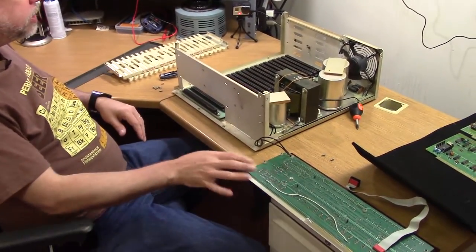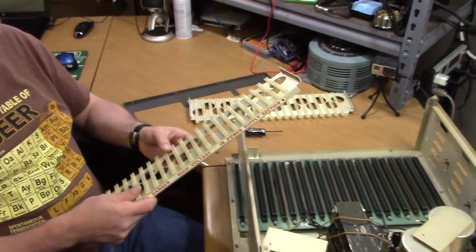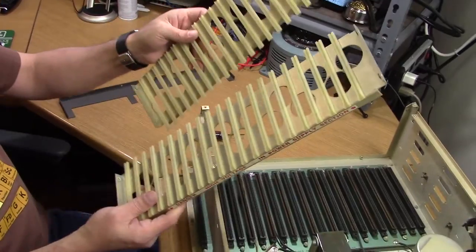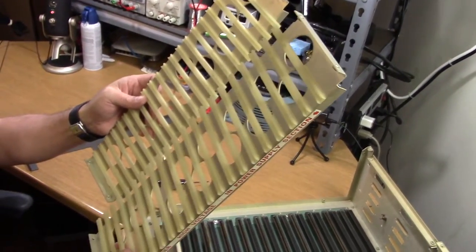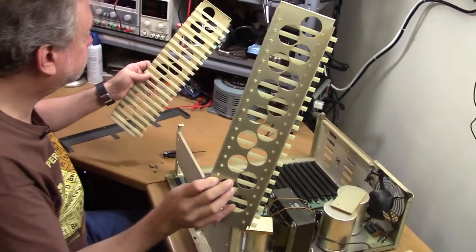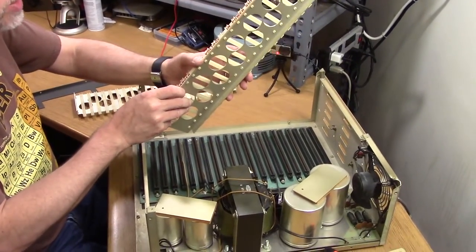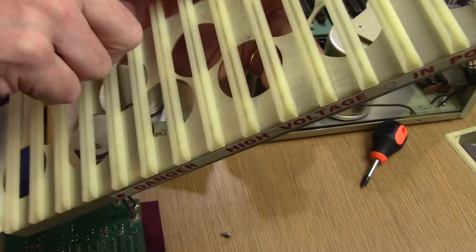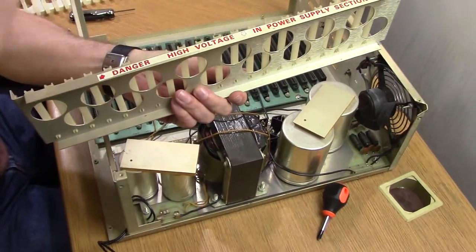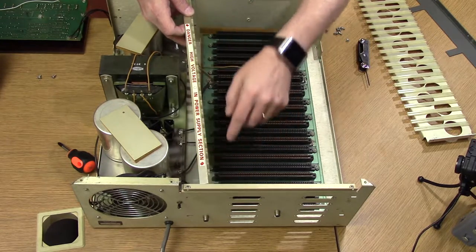Before we can install the front panel, we have one final piece of the chassis to install — the card guides, which hold the cards in place when they're plugged into the backplane. The card guides came from the factory as stamped bent pieces of metal with holes drilled in them, plus a bag with 44 plastic edge card guides which you then snap into place using the holes and friction fits. We make sure to get the orientation correct — the slides are flat on one side but more open on the other, which is the side intended to accept the card from the top. This machine has already had its safety sticker applied by the user.